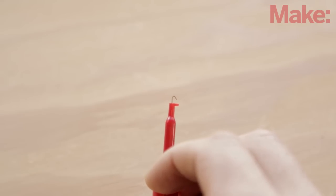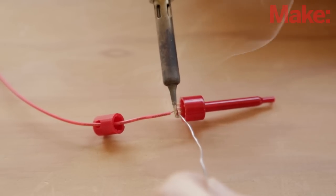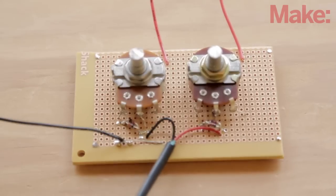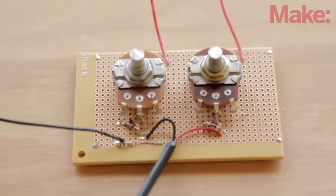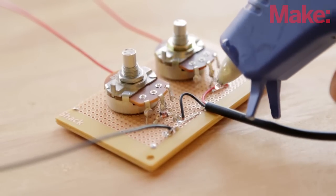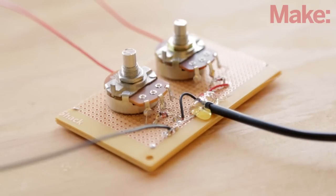The easiest way to probe a circuit is to use test clip adapters. They allow you to clip to a wire and hold it securely, which helps to avoid shorts. You'll want to solder a wire to each of the clip leads. For a two-channel O-scope setup, you'll make a total of three probes — two red ones for the signal lines and one black one for the ground line. After connecting the clip leads, connect the other end of the wire to the appropriate place on the perfboard. The ends of the red wires are signal wires and they attach to the 4.7 kilo-ohm resistor, while the black wire attaches to the ground rail on the perfboard. The perfboard and wire solder joint needs some sort of strain relief so you don't pull the wires out accidentally — a well-placed drop of hot glue on each of the three wire-to-board junctions does the trick.